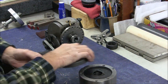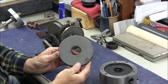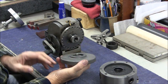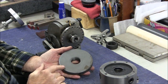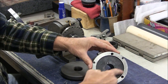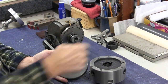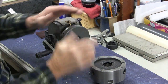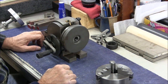So here's what we've got. Here's the chuck — this looks like a pretty decent little chuck. And this is the face plate that adapts the chuck to the dividing head. What I need to do is clean this face off, turn this face right here, and cut a flange in it that will fit in this recess in the chuck. Then transfer three holes to this face plate so it bolts onto the chuck, and then the chuck will fit on here — there's my dividing head with a chuck on it. So we'll go ahead and get started.